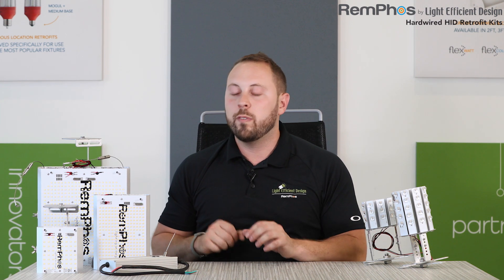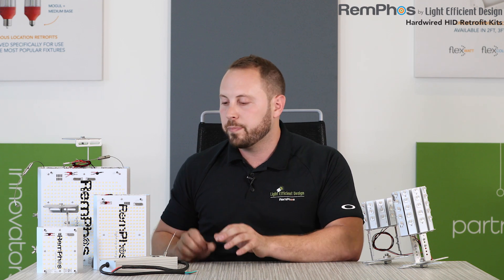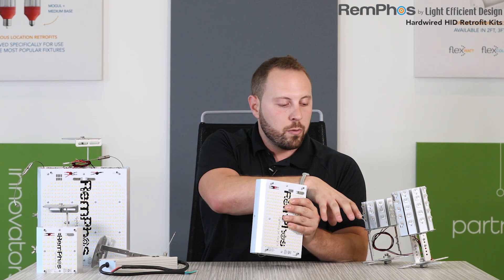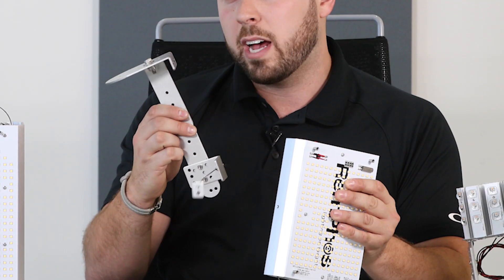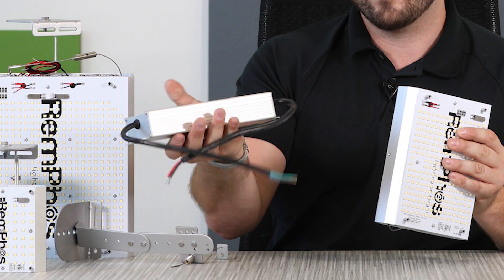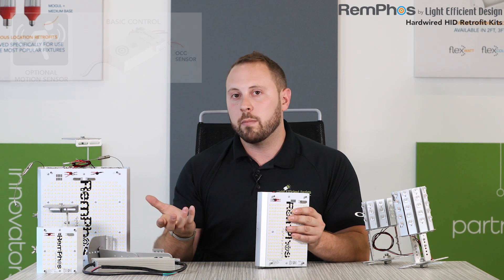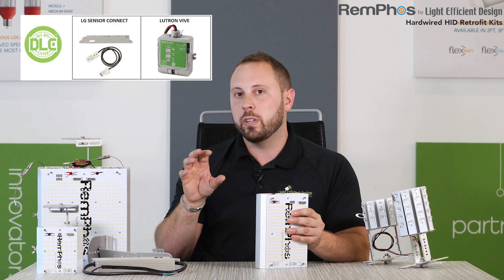On this side we have our LED block — this is our generation three, our third generation. We've been selling these kits for a number of years; this is a super high-volume product and we've put a lot of technology into this latest generation. This kit also comprises a module, but instead of the LED SS-EXT where the base bracket is assembled to the product, it comes with a separate bracket. It also comes with an external LED driver, and dimmability is optional on those drivers. So if you're trying to use control systems — either our integrated motion sensors, daylight sensors, or the more advanced wireless control options — we can make these kits compatible with those options.